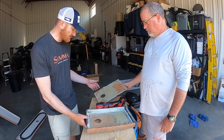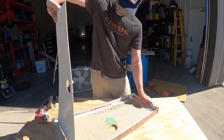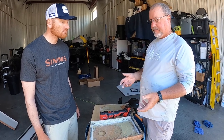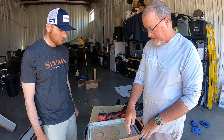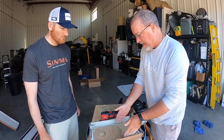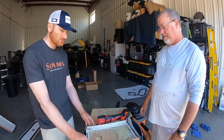We had a very soft compartment and you can see we cut this out with a little zip tool — it's just a foam core deal and it broke down, whether it was water or just because it was really old. Captain Chip zipped this thing out, we separated it, cleaned it up, and ultimately we're going to put a piece of plywood in there. We're actually using multiple pieces of plywood — because with plywood, if there's humidity change or moisture, the plywood will tend to warp and your hatch won't lay flat. So we cut the plywood into smaller pieces so it won't twist or bend, and that way we can wrap it underneath the lip so it'll be nice and straight and flat once we glue it down and glue the fiberglass back on top. You're basically just going to epoxy that back in place.